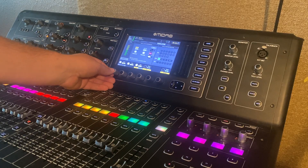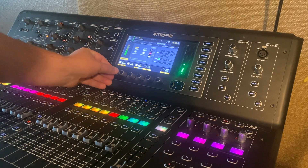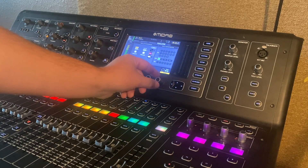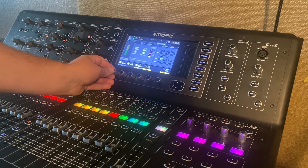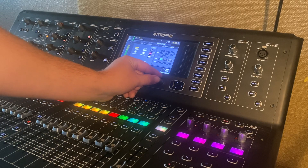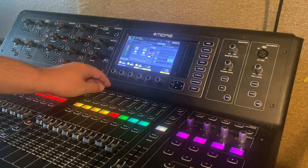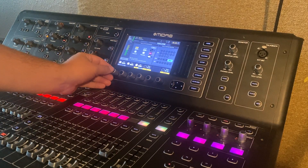For right now, we're just going to focus on left and right. I'll go ahead and assign it to just the left output speaker, press the button to generate pink noise, and then slowly bring up that noise. Then we can turn it off, send it to our right channel, and hit the button to generate it again. We could also go to our mono center channel that our subwoofer may be living on, as is the case here, and generate again.